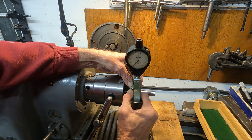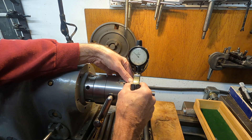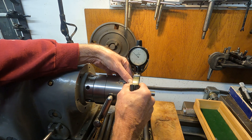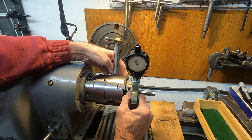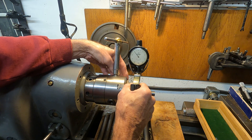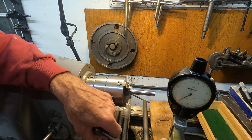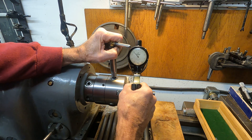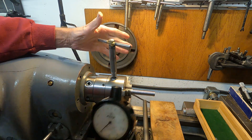Let's have a look here — let's clock this thing. I suspect this is out of round too. I'm going to rotate it some more. Right about there. I'm seeing about three ten-thousandths out of round.